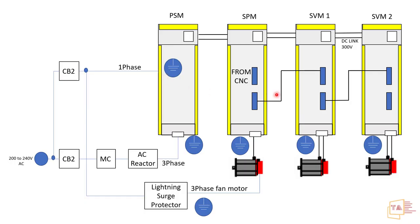This is the overview of the FANUC drive configuration. If you take any FANUC CNC machine, you will be able to find PSM, SPM, and SVM. These are the drives used by FANUC to drive the axes in the CNC machine. PSM stands for Power Supply Module — it supplies power to the entire servo drives and spindle drives.